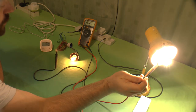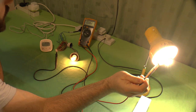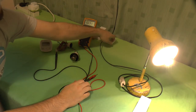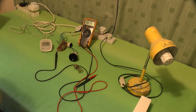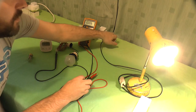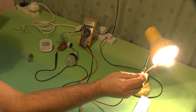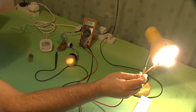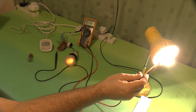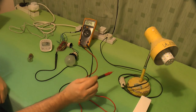That should not happen. Like I said, 83 milliamps, 26 watts I'm pulling now. In fact, what the hell? Let's try that with something a little bit beefier. Let's try it with 100 and see what happens if I touch that contact there. Now I'm going to pull back this time. I'm pulling 32 watts. 157 milliamps of leakage current. That is strobing like buggery there. It's taken down an entire section and it's just gone off.